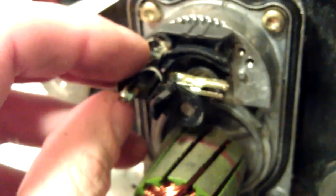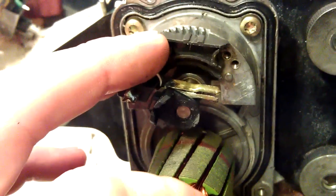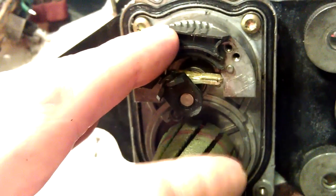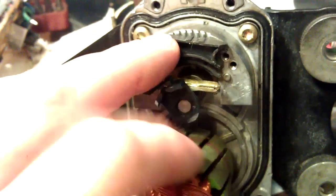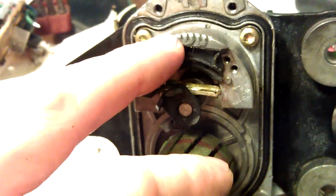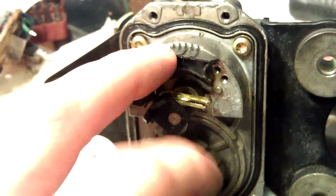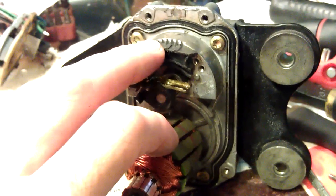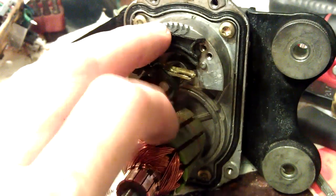The contacts slide right along here. When you accelerate, they rise up, but because of the wear they rise up a tiny bit slower than they should. When you decelerate, they touch a little bit faster than they should. Therefore the car goes into limp mode because it's registering an error — they should not touch at that specific value, but they do.